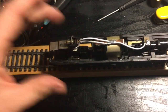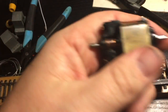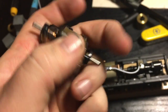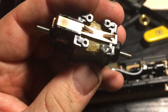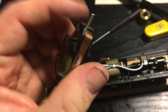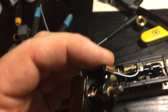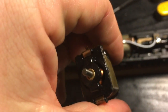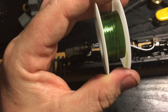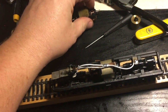In this case I also replaced the motor, because I'm not entirely sure what was done to this motor but it was thoroughly trashed — it's been super glued. I will take it apart, clean the brushes, clean the contacts and rebuild the motor. I will actually probably rewind this motor, make it a little bit better and use it as a spare motor for another locomotive.